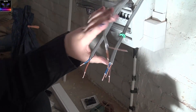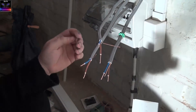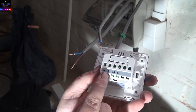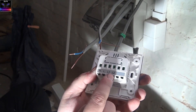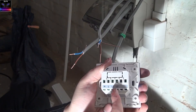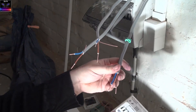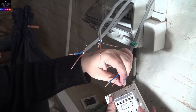First, I'm not going to cut the wires yet — I'll just test how it works and get the app working. Let me explain the wiring first: the live input goes in here, and then it switches live one and live two when you press the buttons. So L is live input, and L1 and L2 are outputs for light one and light two. L doesn't stand for light — it stands for live.